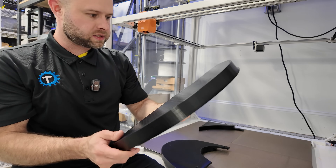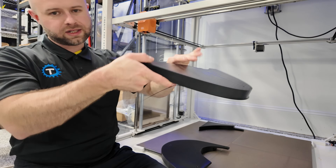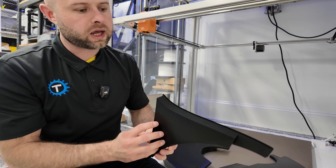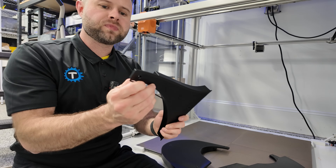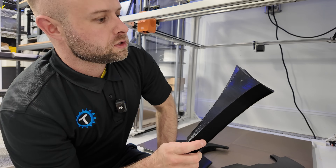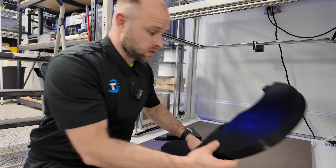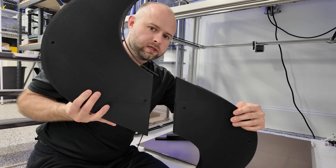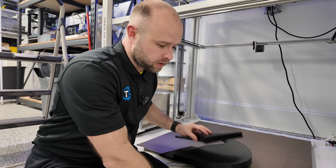Very consistent across the build plates — that remeshing kind of did the trick, just getting the Z height all in place. A little more lifting there, so maybe some glue on the build plate and more brim, because this is like five millimeters of brim — it's not a lot. With this much filament it probably makes sense to go ahead and do a bunch. So I'm going to make those adjustments and reprint this, because again this is only two kilos all in. It's a quite large letter S — about three feet tall by maybe two feet wide, so it'll be nice and striking.